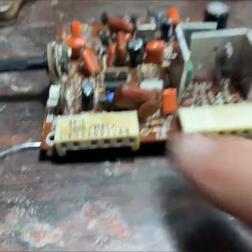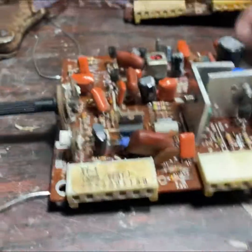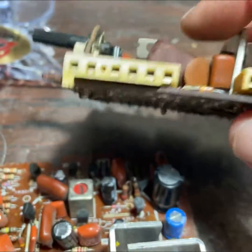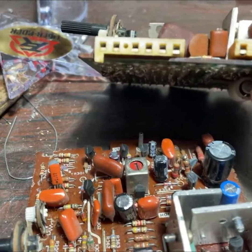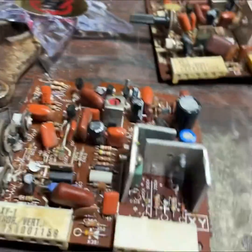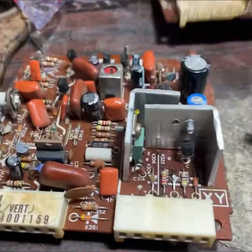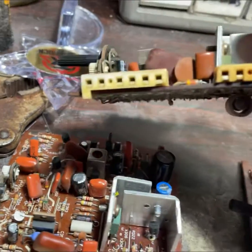One of the main problems with these cards are the connectors — these headers are getting very old and I can't seem to find any replacements. As you can see, they have a clip there, and as they age they start breaking off and getting very brittle. What I like to do — perfect example right here, this one's broken off — I will superglue it, put some superglue right here, squeeze it down for a minute and superglue it so it doesn't move.